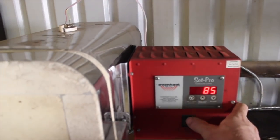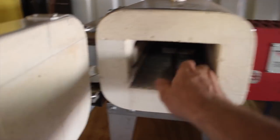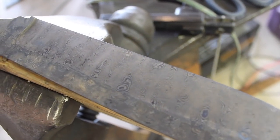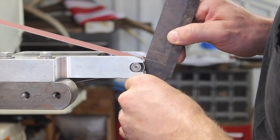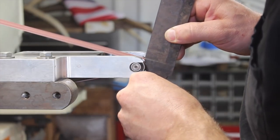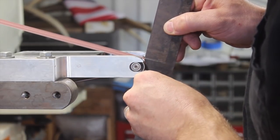Hey guys, welcome back to the shop. Part 3 of our first Bowie Knife in Texas build. So the first part we forged the Damascus or pattern welded steel from saw blade and 1095 high carbon steel. Then the second we did a bunch of work on the blade, heat treating and so forth. Just pulled it out of the kiln for the tempering cycles and it is fully heat treated now and ready for all the other processes. You can see the pattern a little bit there — obviously it's going to be a lot better once it's all done, etched and everything.